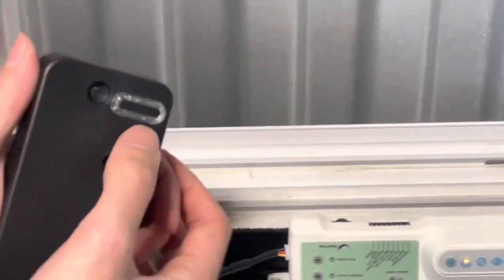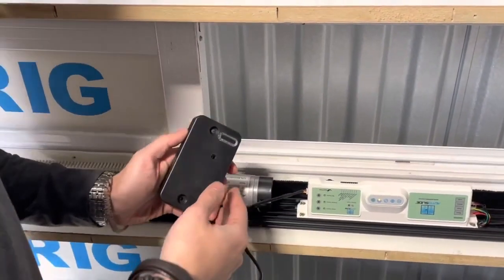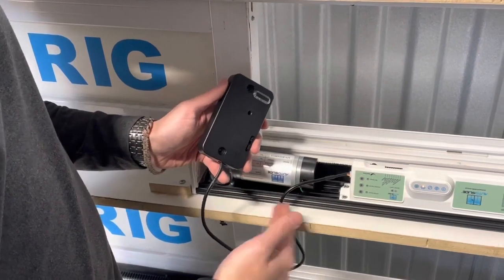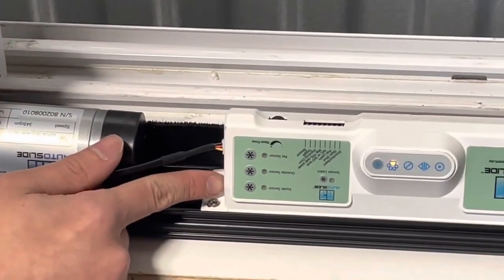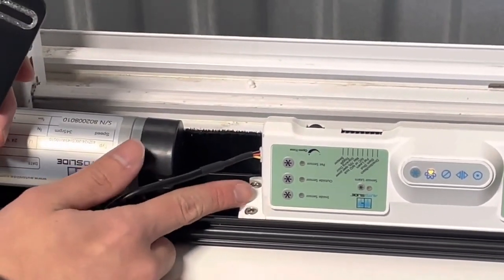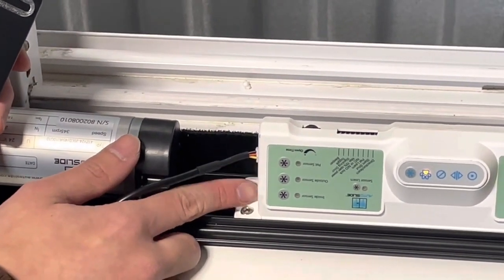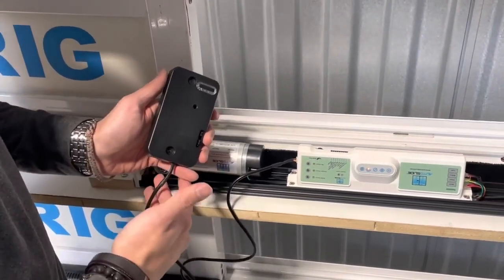You'll see that I get a flashing blue light and then it's going to go off. If you're using this for disability, or if you just want the tags to open the door to a full human opening, then you can plug this into either the outside or inside ports, which are going to be your top two ports. Again, in my case these are going to be the bottom two, but if your system is installed at the top of the door, it would be either of these top two ports. I'm going to continue with setting this up as if it is for pet usage.